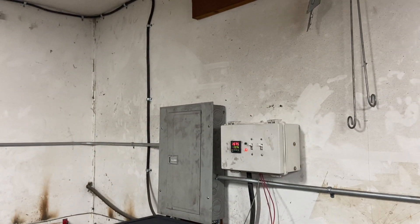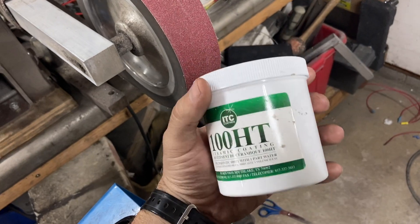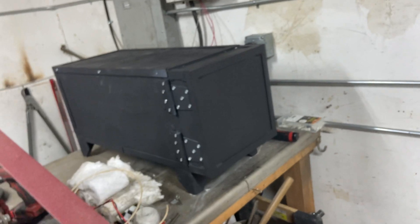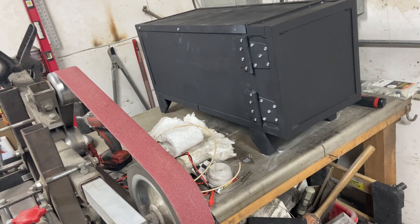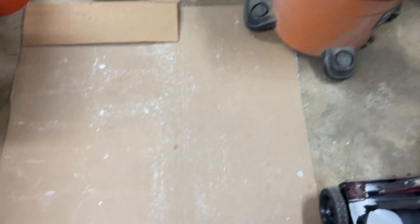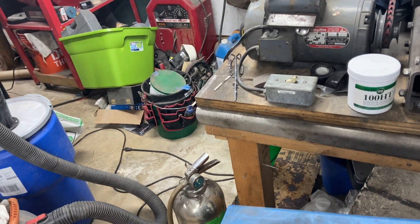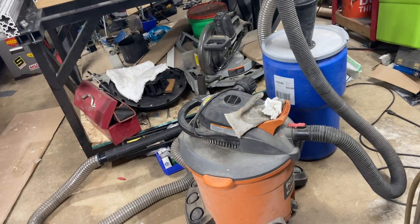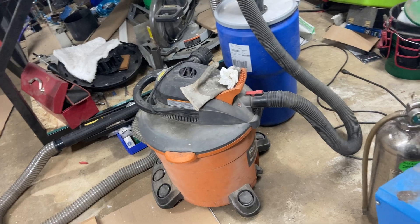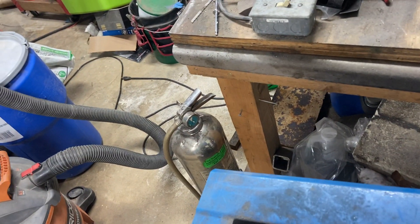As far as I can tell, this stuff is worth the price of admission. This little pint jar was about $50 shipped to my door. To go over the process: I took all the bricks back out — I could have coated them in place, but I didn't want it dripping everywhere. I laid them flat on cardboard on the floor, mixed what I believe is two parts ITC-100 to one part water using some distilled water, mixed it to about the consistency of latex paint, and then brushed it on the faces of the bricks that would be facing the inside of the oven. I just had enough with this pint jar to coat all those bricks.